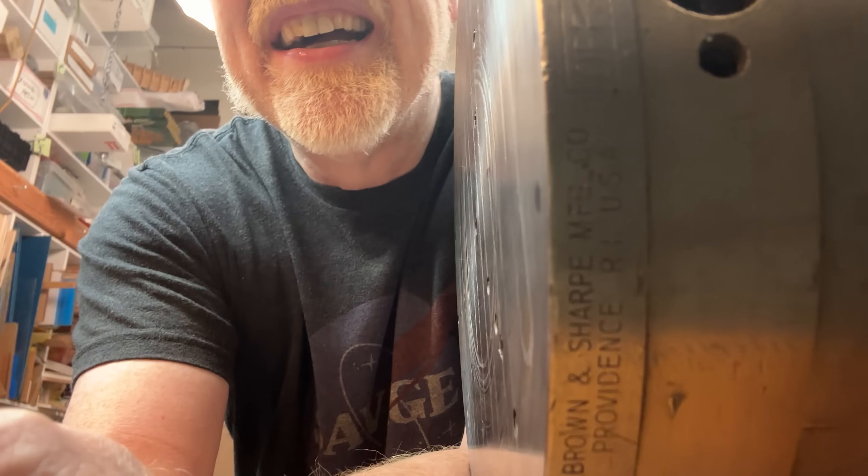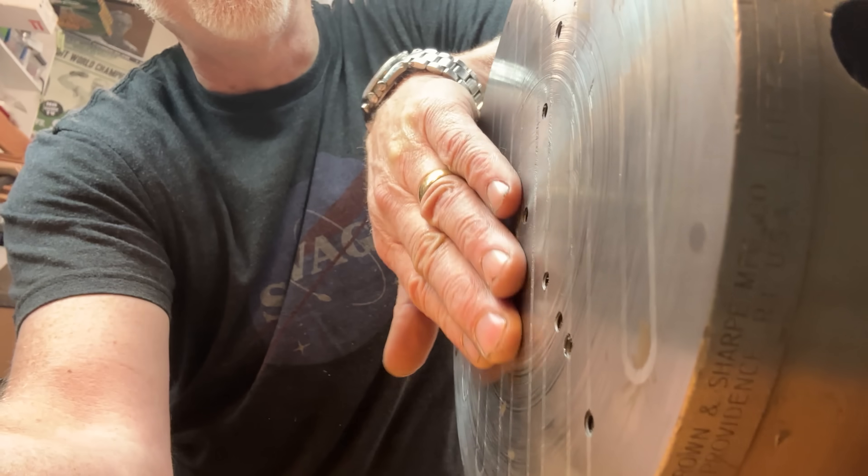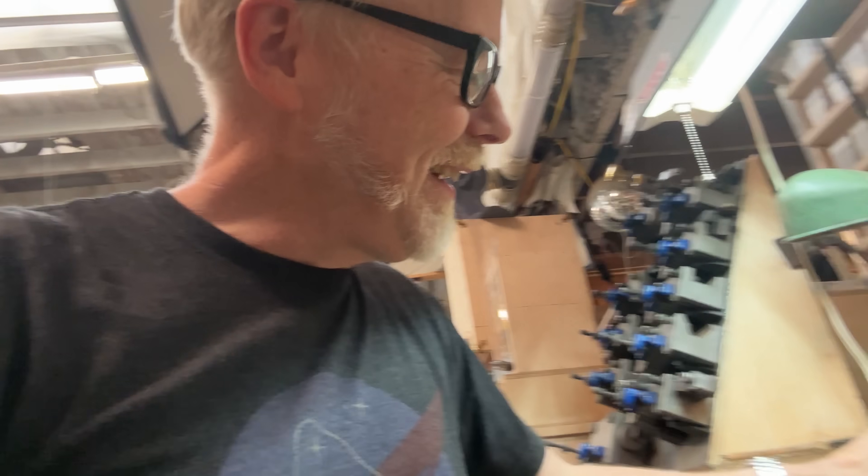It's still usable, but when my stuff isn't properly taken care of like this, I tend to avoid it — not because it's not pretty, but that should be addressed. Normally if you wanted to address that, you could do a surface grind — it's a great way to get things nice and flat. I don't have a surface grinder, but I have a tool post grinder, which is a surface grinder for the lathe. I'm going to set it up and try to grind that face flat. We'll see if I can do it.